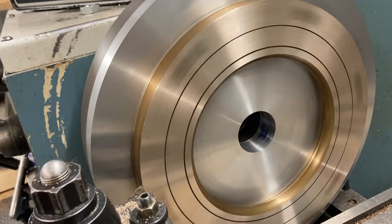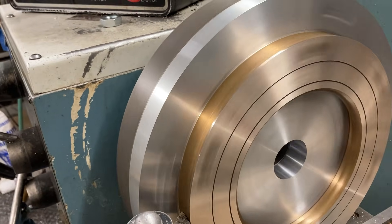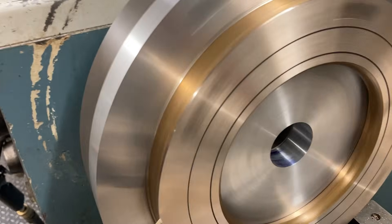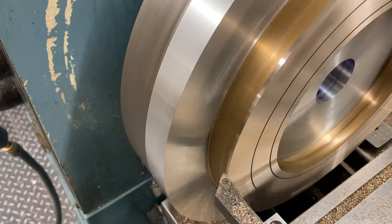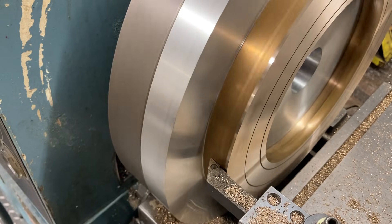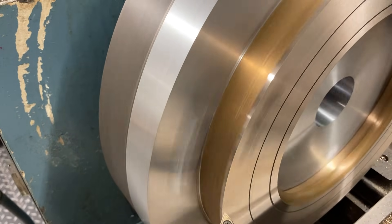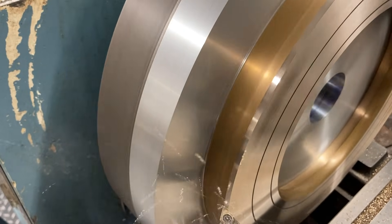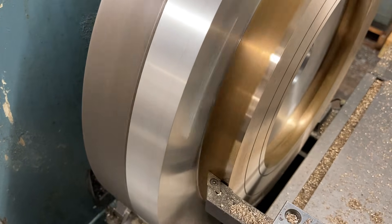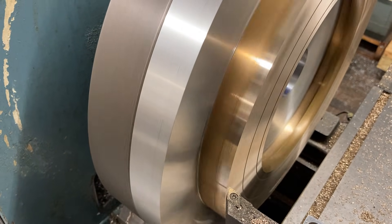The holes on the OD — that crowned edge was so nasty I couldn't even get the drill in the hole. So I'm going to have to be a little cautious pistol drilling those. Once I get that nasty edge off though, it'll clean up a little bit. It's cutting all that nasty off — like I said, it looked like somebody beat the snot out of it with a three pound hammer. We go right to the face plate. On the face plate, I put a relief so that I could turn off of the part.